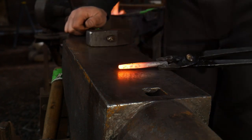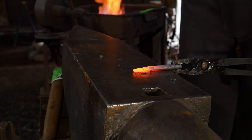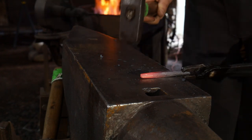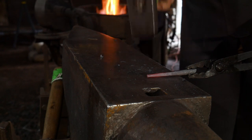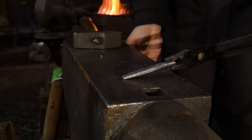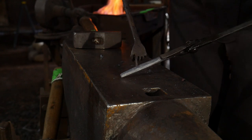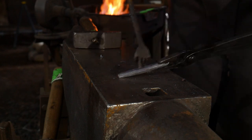Here we are. We're going to go from the 90-degree dimension and turn it up on a diagonal — up on the corners — and hammer straight down to really flatten out that side dimension. We're not going to take off this corner; we're going to leave it and forge down that dimension. So now you end up with something that has a flat here, a flat here, a sharp there — a flat, a flat, a flat, a sharp. You've got a sharp on two edges, front and back.